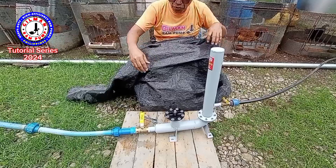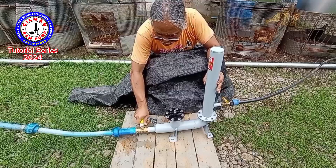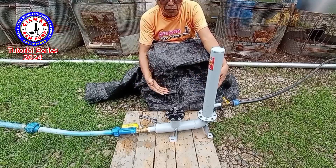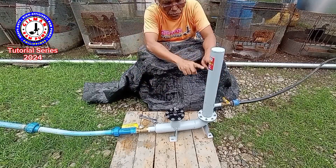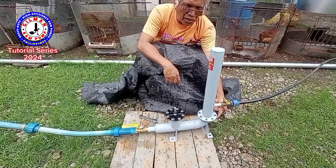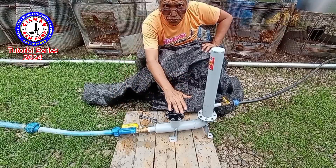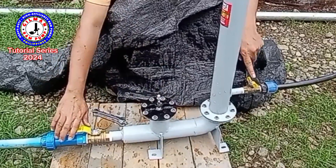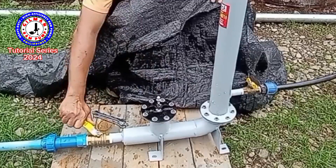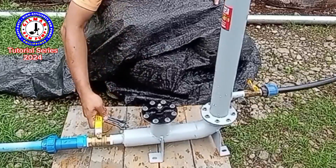When I open this, the plunger goes up. It does not operate on its own because the air inside the air chamber is being compressed right now. Water coming out from the vent — don't worry, that's normal. Do not push the plunger; just close this one. Remember, when I close this one it will go down. Just like that — and when I open it again it resets.